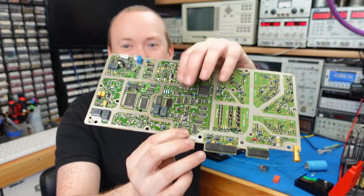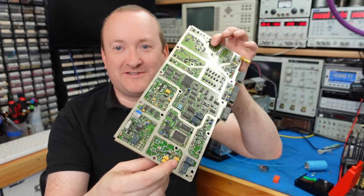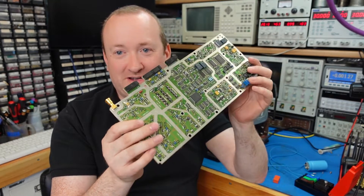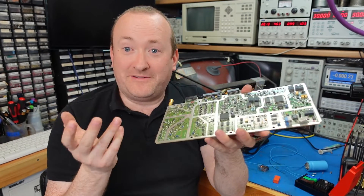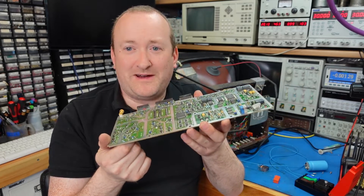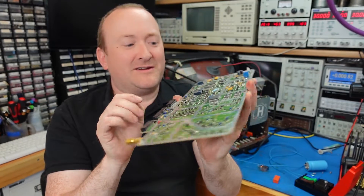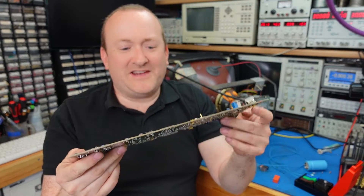In most cases, especially with vintage stuff, you don't want to go near 100 degrees. I tend to dry things at about 75–80 degrees — it's good enough to get all the water out. Modern circuit boards with surface-mount components are quite often safe to put in without any worry. All the components are rated for reflow soldering — modern lead-free solder needs about 220 degrees to melt — so none of these connectors are going to melt, and the capacitors will be up to it a lot better. Less worry with this sort of board.